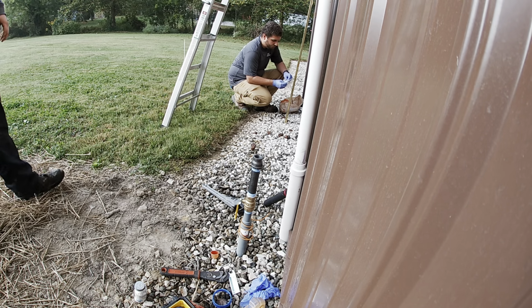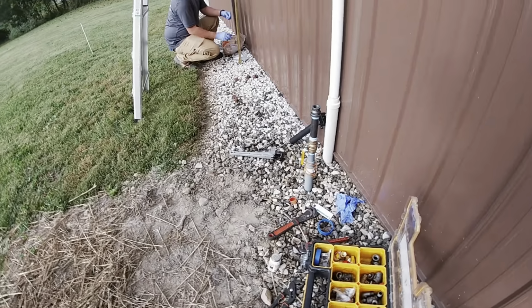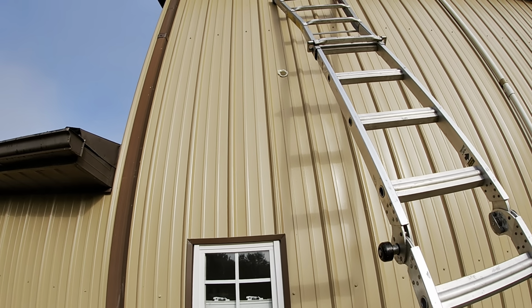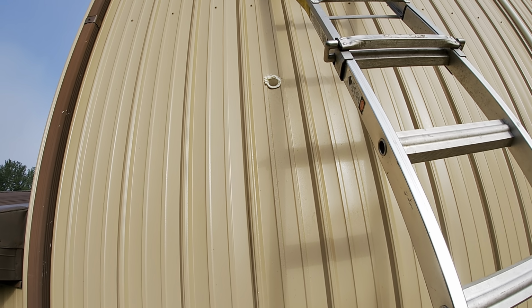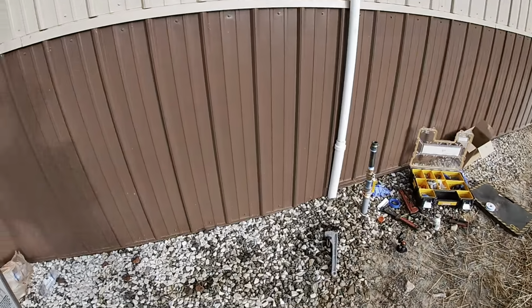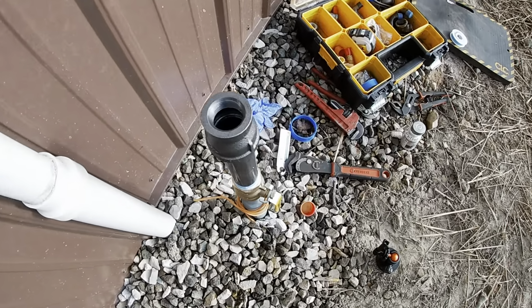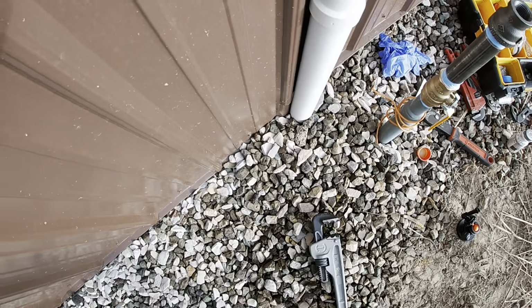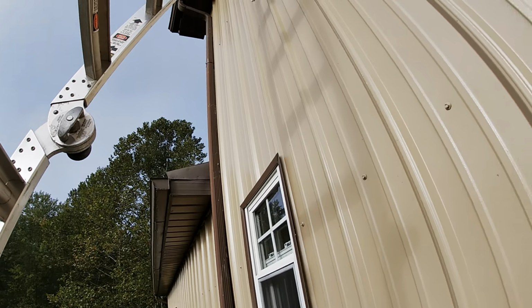So you're just gonna cut that strut in like 6-inch sections. All right, we got our pipe going through. Run the gas pipe through. We're cutting the Unistrut now. And we'll come off of this 90 over towards the wall and run it down through here with a few clamps, and then go up and do the same thing.